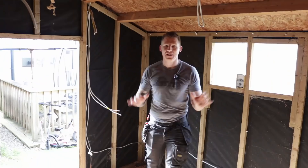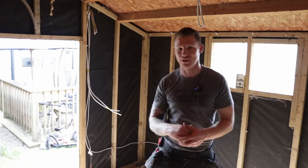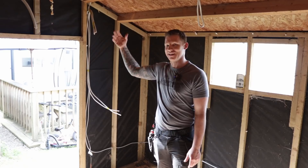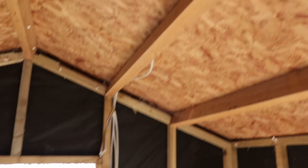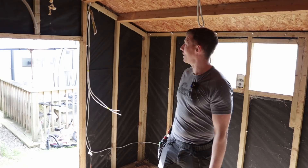Now I have to do the electrics before I put the insulation in — I know a guy who can do that. The electrics are in place. I'm keeping this super basic: just a couple of sockets and a couple of lights, reusing the existing supply that was already out here. It's backed by a 10-amp RCBO — or 10-amp GFI as you'd call it in the States. So there's a little sub board, a light switch, socket, an outdoor socket for the pond, another socket on the other side, and two lights. I'll cut the dry-lining boxes in after the OSB goes up.